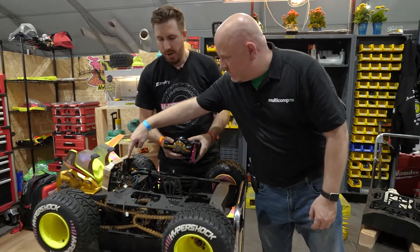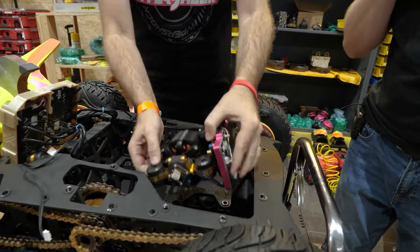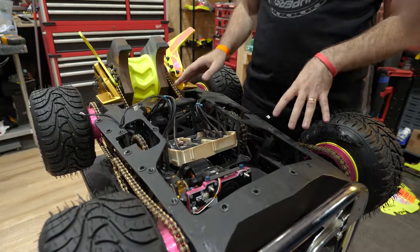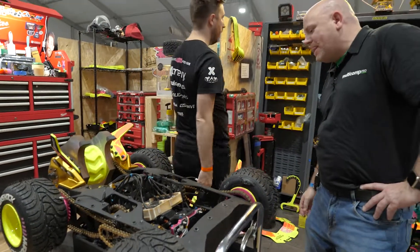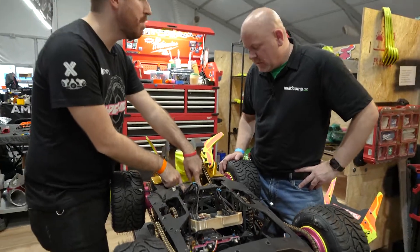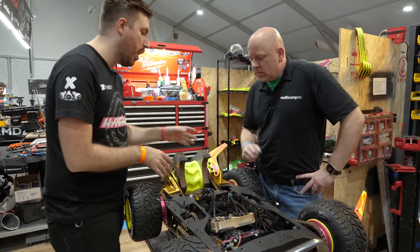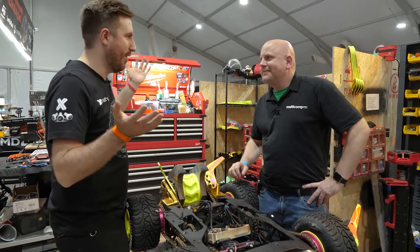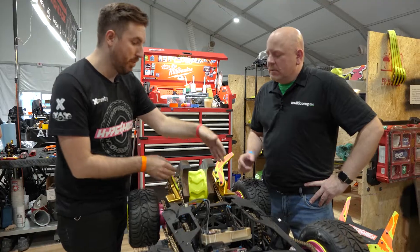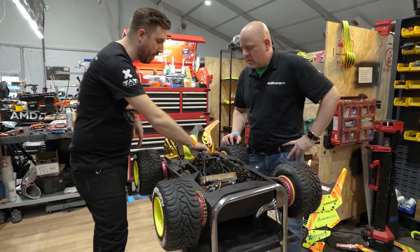So this unit is here — one of these goes here and one of these goes there for the drive, and the same parts are separated for the weapon. For the weapon, we have two of the same motors back to back on a common shaft. We did that for redundancy of the motors. We know if there's a jam that's a failure point, but you can't have it all. It's already saved us — we lost a chain in one of our matches, and thankfully because we have the two chains on the same shaft, it still worked with full power.